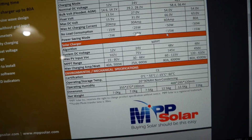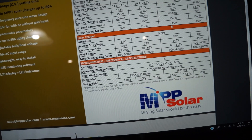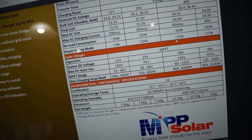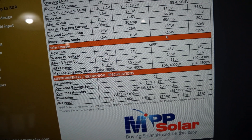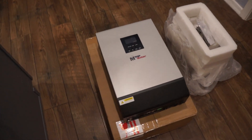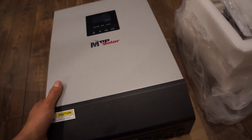This unit is strictly 230 volts, not split phase. My plan is to only run my HVAC air conditioner at the other house, which uses 240 volts, so 230 will be fine. I'll also run the range and install a 220-volt mini split air conditioner in my garage workspace. The rest of the house will remain on the grid, which is why I went with this inverter — and because without a transformer for split phase, it's extremely light and small.